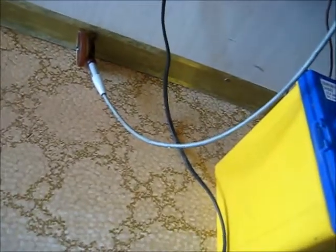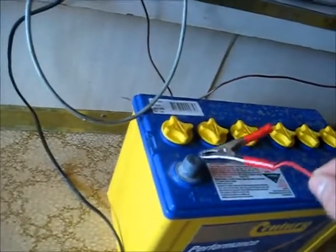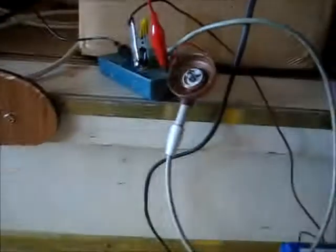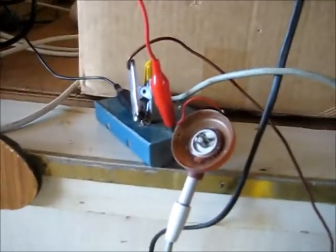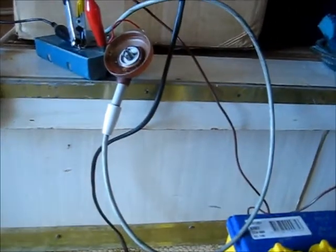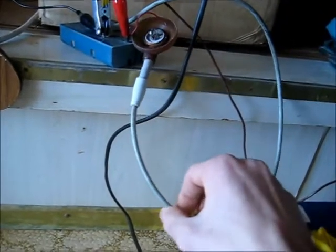There's still voltage in there, so that's capacitor-based. I've got to discharge that safely before I handle it — or else I'll get a shock. There you go — the spark that jumped off that. Keep those flyback multipliers that come with those AC flybacks from these older TVs. Definitely worth keeping. Look at that spark that jumps on there.